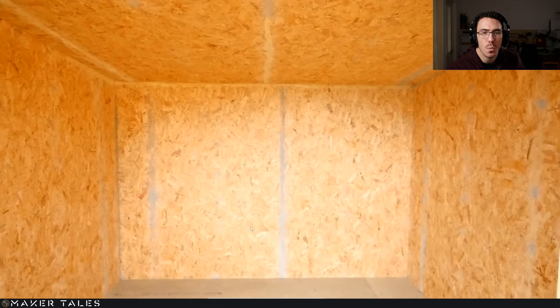And here, you might be wondering, what is all this? Well, I basically just went with some wood filler and some thick gap filler here. This is the stuff that is basically to fill up plaster walls that have holes that are more than 50 millimeters deep. So I could just go at it with this. Remember to just fill it, let it dry, and then go again and then sand it down, because that's going to be your best result.